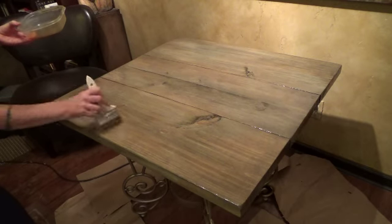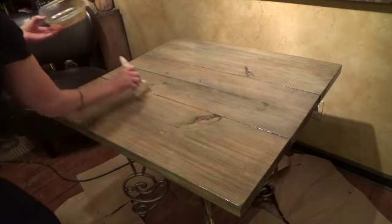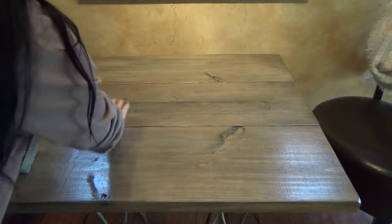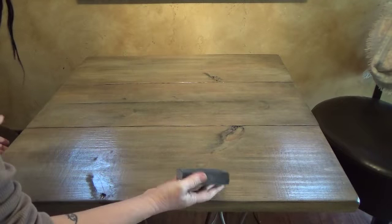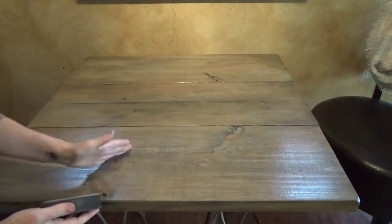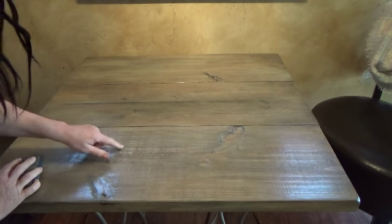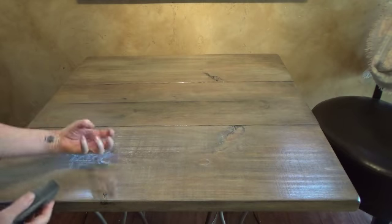Just building up the luster — we've got all these beautiful hues on there, it just gets richer and richer. I'm really happy with this — I'm delighted. So the top coat has sealed overnight, with the fan on it all night. Now I'm going to take this soft sanding sponge and sand in a circular motion because I want to hit all the angles of the surface. It is pulling some of the finish up on the peaks, and I like that — I'm going to let that happen. It's looking dry now, but we're going to put a second coat on and it'll pull the luster back up.